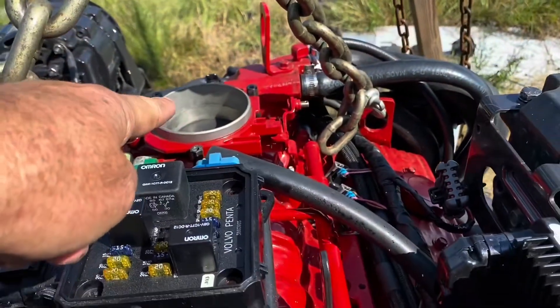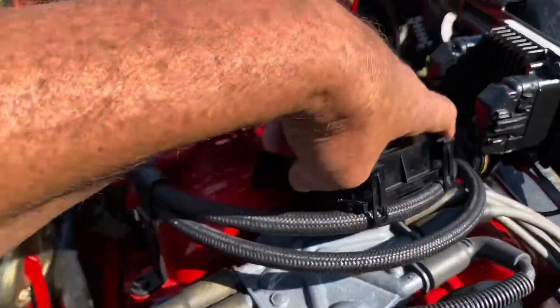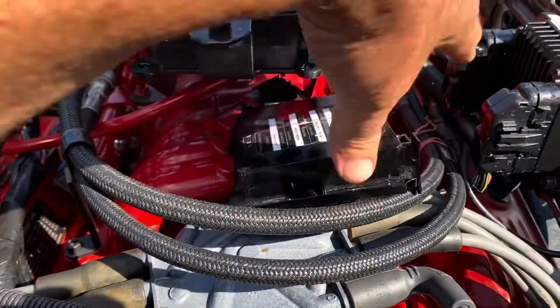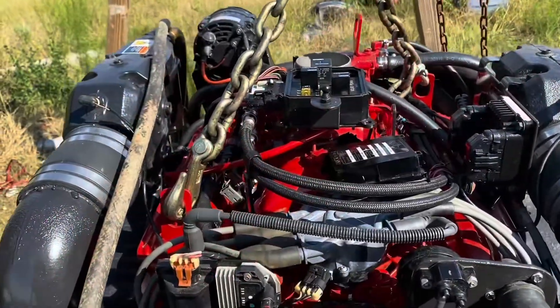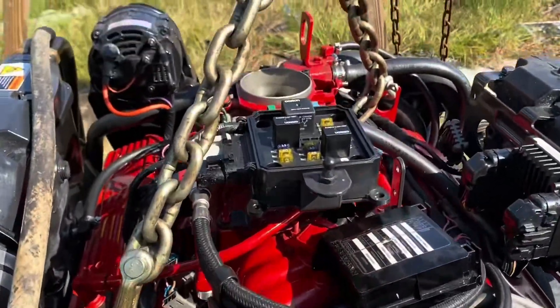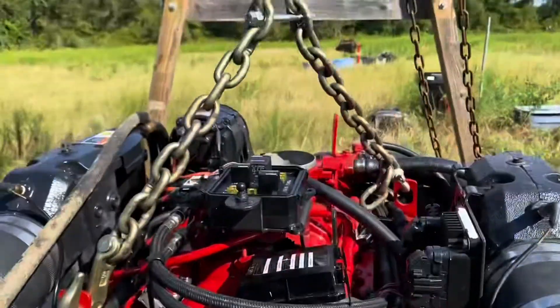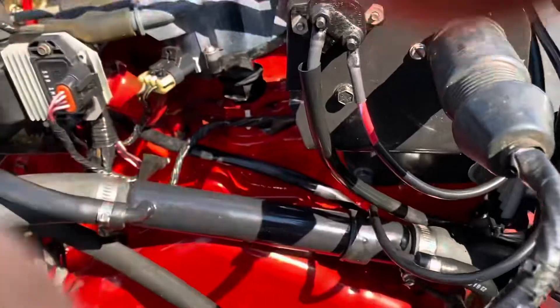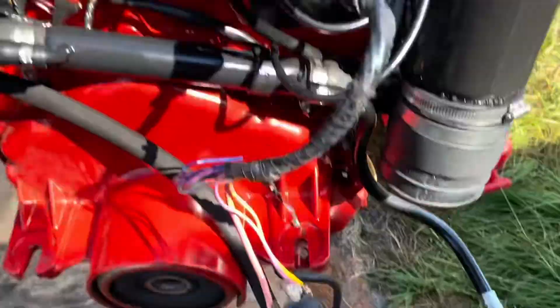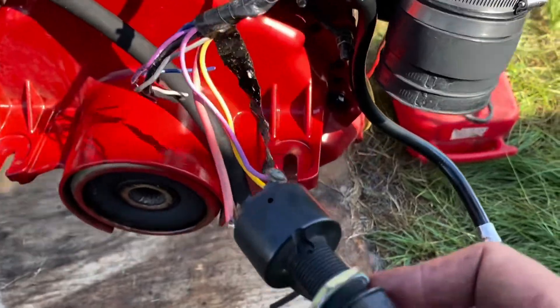What I'm going to do right now is pour raw gas into the throttle body — about a tablespoon full — and then try to crank this thing up. It'll run for maybe a second or two, just to let me know that it's ready to run. I've got the water flowing, I've got a little bit of gasoline primed in it. I've got a key system here — a hot-wire circuit for the ignition — so I'm going to go ahead and try to start it.